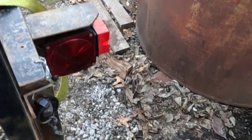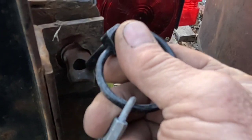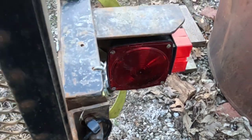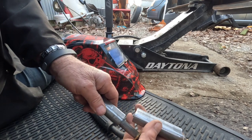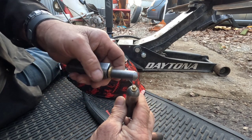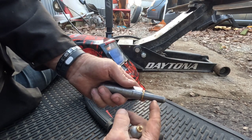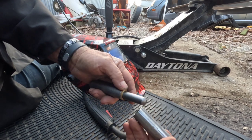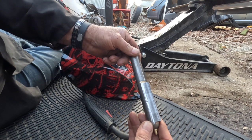So that hole's really fairly precise. Yeah, and that one's actually pretty good too, other than where it's worn into this clip, because the gate, everything was out of whack. And the hinges he brought me, these are kind of cool in a way. They're greasable, and when I took the old ones off, this pin had broke free on this side, but that pin's fixed, and we got a little brass spacer. And we can put these up there and adjust them.